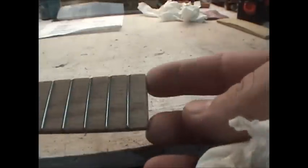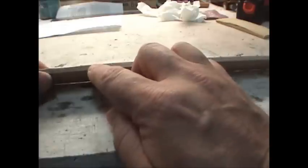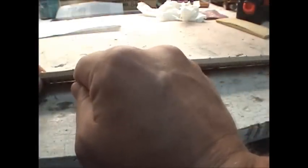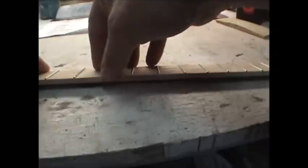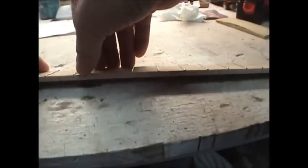The fretboard is done. I actually cut it off now that I've finished the frets. You can finish it here — you can stain it. What you can do is mark your scale positions: the 3, 5, 7, 9, 12 on the side using a marker. If you want, you can take a file, notch it, drill and embed something into the wood to mark your frets. What I'm going to do is drill some holes to countersink some BBs in there to be my markers, and then I'm going to stain it black.